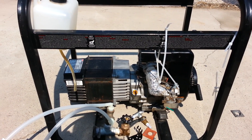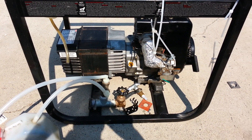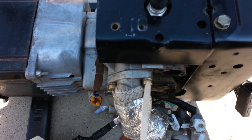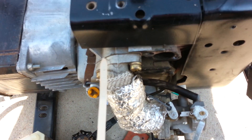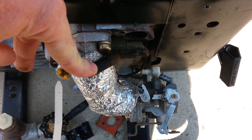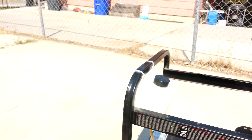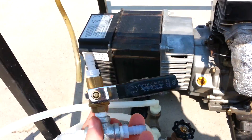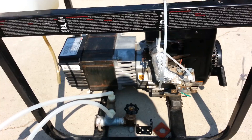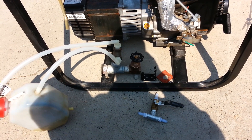This will allow me to plug in specific loads and test the difference between a cold vapor system and running my engine traditionally through the carburetor. You can see down there I pulled this black hose off — that black hose is just a return line to a drain line, and the white barb fitting is where the fuel line goes. This right here is my gas tank, and I'll have a tee right here so I'll be able to send fuel through to the vaporizer. I'll have another valve so that I can send it through to one of two paths — one for the carburetor, one for the vaporizer.